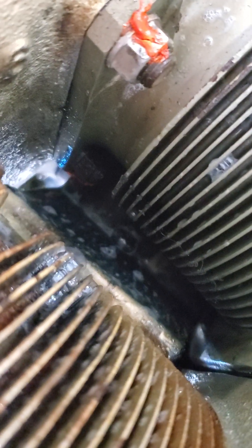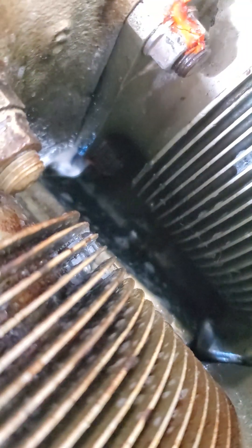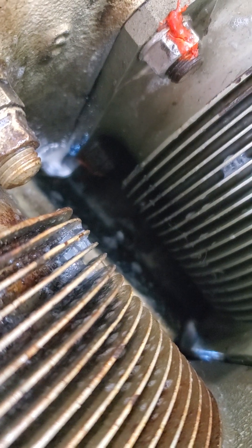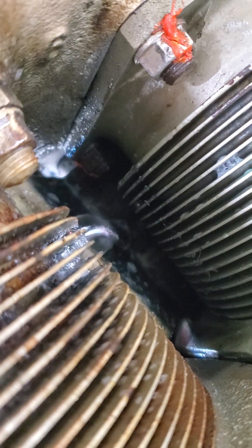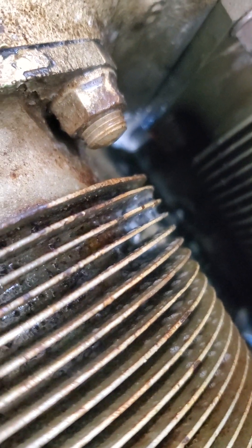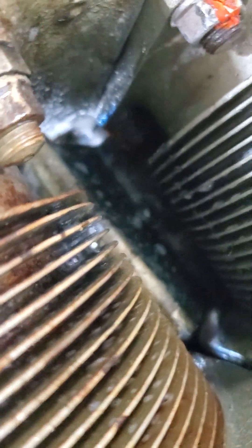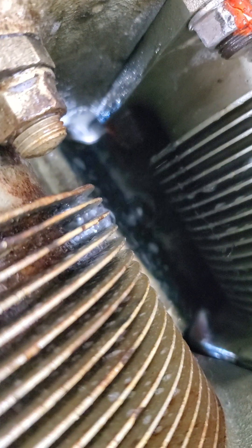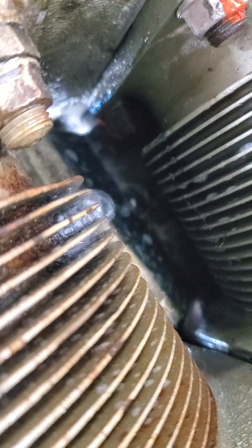What happened here is we were solving some oil leak issues with the pushrod tubes, and he was still getting some oil leakage up by number six on the cowling. So we did a compression check and didn't really find anything. Andrea suggested: could the cylinder be cracked somewhere else? We looked, and sure enough on the bottom of the stroke you can hear the intake valve open — and there it is. That's pretty crazy.